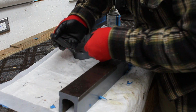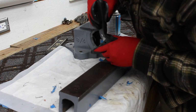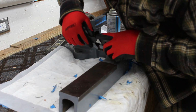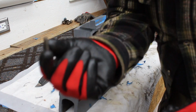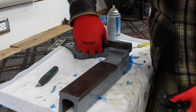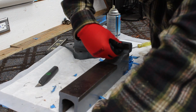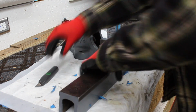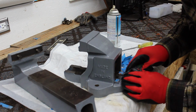The screw holes here are turned out, they're 1/4-20, but the threads were a little bit rusty, and it was actually very difficult to get this apart originally. But fortunately, I have a 1/4-20 tap and die, and so I was able to run those out and chase the threads on both sides. So now the screws and the holes all go together really easily. I couldn't have done this with my fingers before. So there's that part. I need to bring in the handle. Oh, I gotta finish this side too. Okay. Now this part. Got some tape back here on this bearing surface.